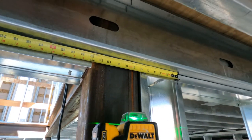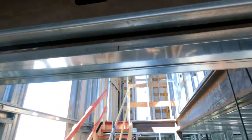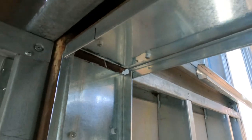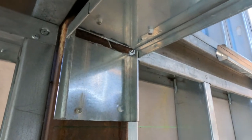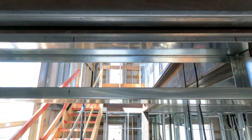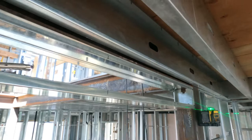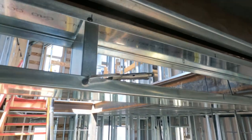Carrying your centers, your 16s from the wall into the bulkhead — always. Laying it out: 16, 32, 48. I always usually put two shots in the bottom of my studs on the iron there and I screw it in to the top track eventually.